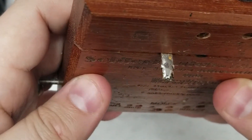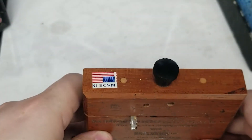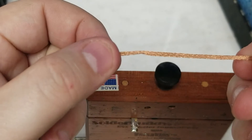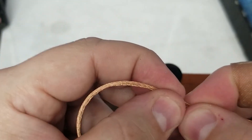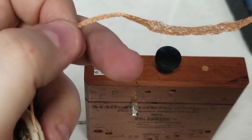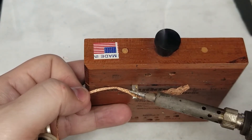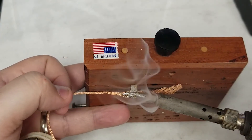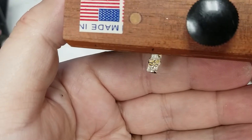If you have too much solder on a connector, such as this Traxxas connector, you can use a Dremel tool or file to remove it, but my preferred method is desoldering braid. Take the desoldering braid on its spool — keep it on the spool as it gets quite hot — open up the braids by bunching them, lay it over the connection, and place your iron on top. As soon as the solder liquefies, pull the desoldering braid and it will pull up any solder on the connector, leaving it much cleaner.